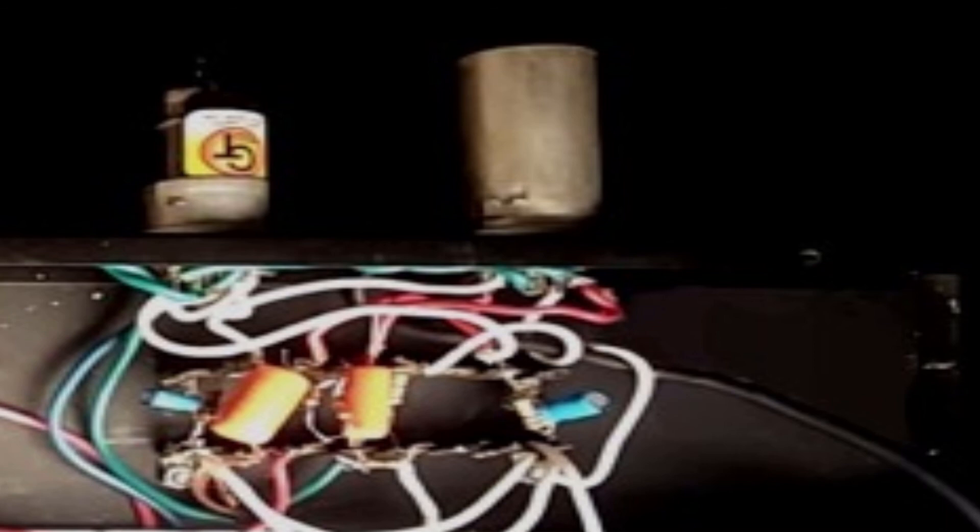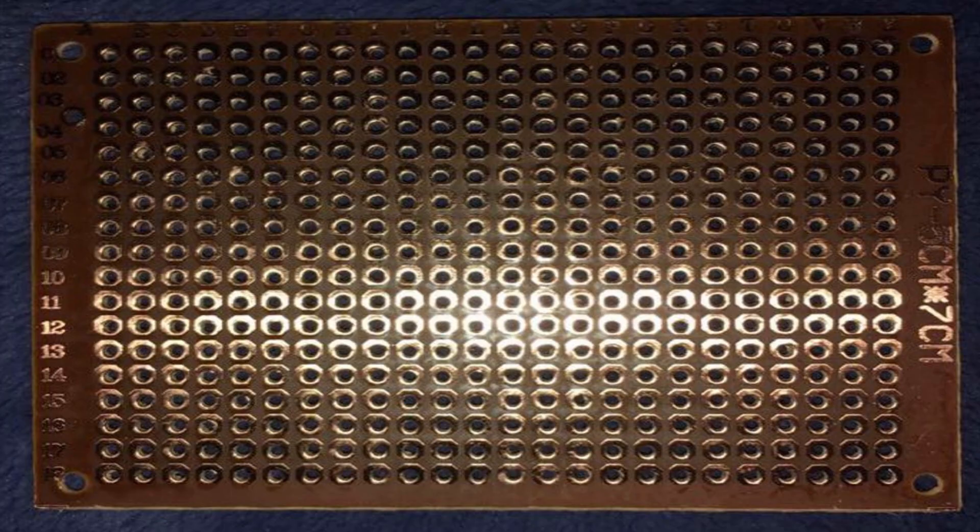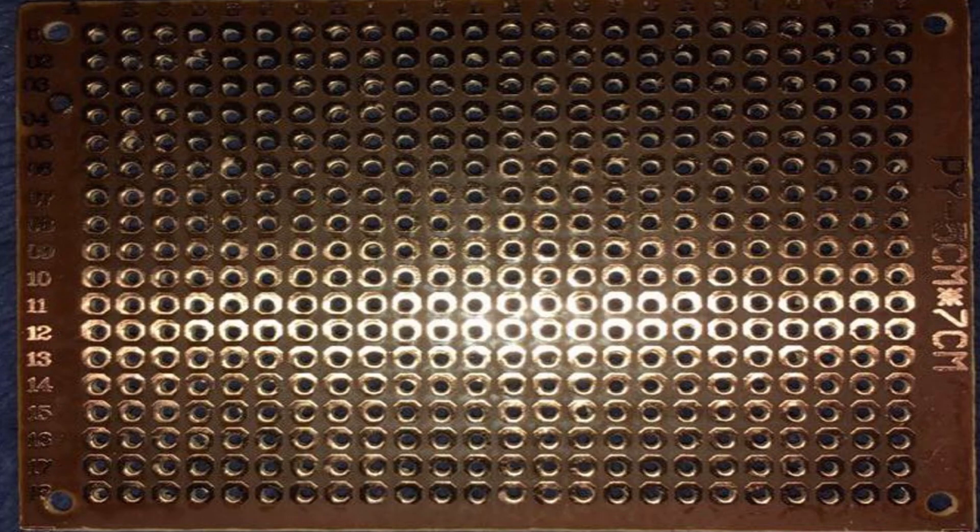Now a little bit about how everything is connected together and held in place. I used two types of wire in this preamp: most of the hookup is done with basic multi-strand or solid core copper wire, and the audio signal path uses a shielded cable to reduce noise. I used old-style point-to-point terminal strips to wire all the components in a traditional 50s and 60s fashion — two pins on each of my strips are attached to chassis ground. If you prefer, you can build this with perf board, turret boards, or even printed circuit boards. My drawings are for terminal strip construction of the tube portion, but I did use a perf board for the power section. Perf boards are insulated circuit boards with copper rings and pre-drilled holes — components are soldered to the boards and wire or component leads are used to form circuits.